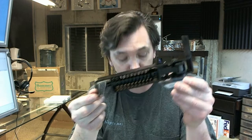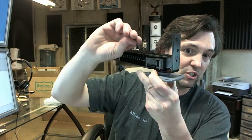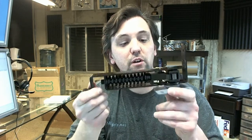You don't want your radius to be any different than an inch and a half, because the radius on the heel plate is also an inch and a half. I encourage you to reach out to me if you have any questions on this item before you buy it. Also, you can set the spring tension — you can see the holes in the ratchet bearing here. It will come with a tension bar and you can insert that, give it a turn, and set the tension on the spring to work in conjunction with the door width, height, and the speed at which you want it to close.